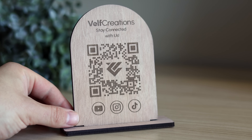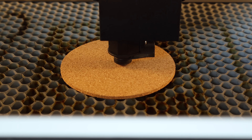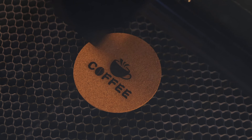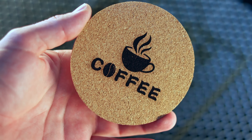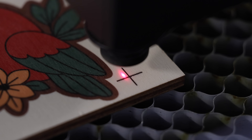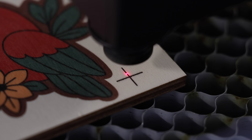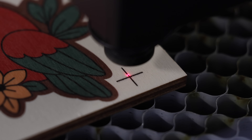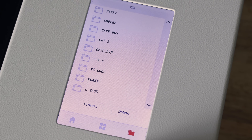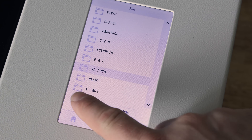The touchscreen on the XRF has been great. You can jog the laser head, start autofocus, and run files directly from the internal memory — it's all really intuitive. You don't even need to stay tethered to your computer, which is perfect when you're doing repeat jobs or batch runs. The red dot alignment tool is another feature we've leaned on a lot. It's aligned perfectly with the beam path, so lining up cuts or engravings is quick and super accurate, especially for layered acrylic signage or UV printed pieces. We've been storing files right on the machine, which means we can run entire batches from the touchscreen without having to open LightBurn. It's small stuff like that that really streamlines your process.